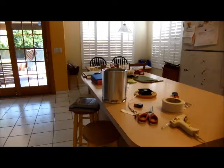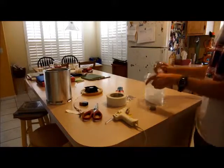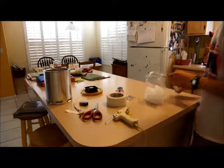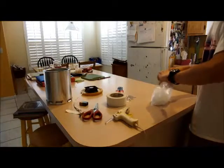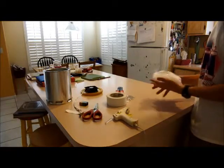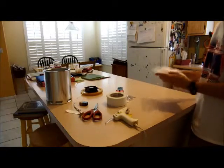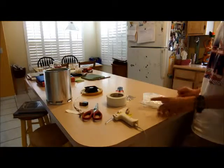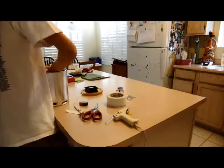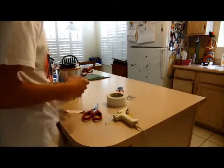Okay, here we go. Salt. If you have your bag of ice, you can take some salt and put it inside the bag. Now basically, the salt and water reaction robs the surrounding air and anything in contact of heat. So this salt basically lowers the melting point of water. So these ice cubes will begin to melt, but they're going to be very, very cold. And that we can now put in here, and see what that gives us.